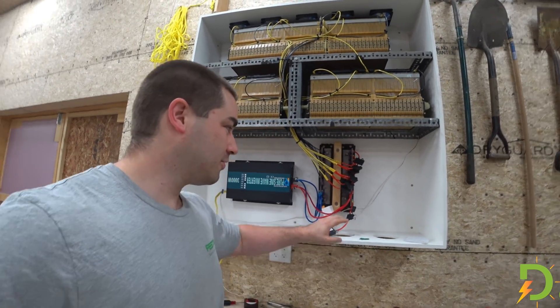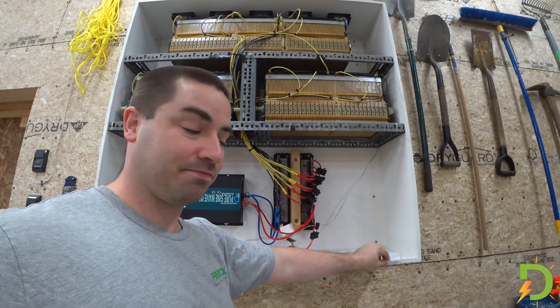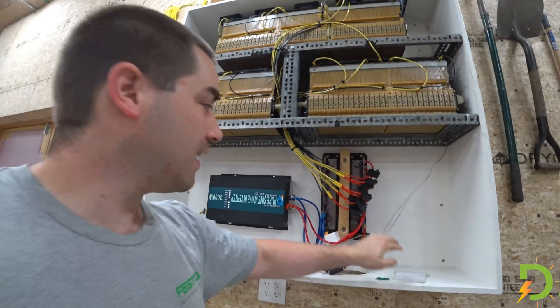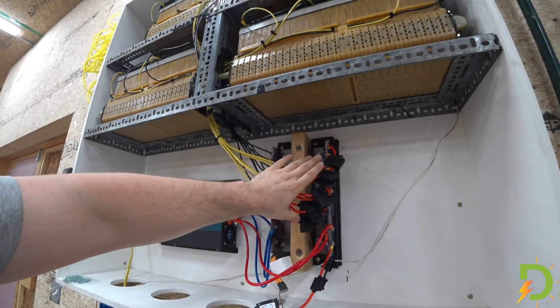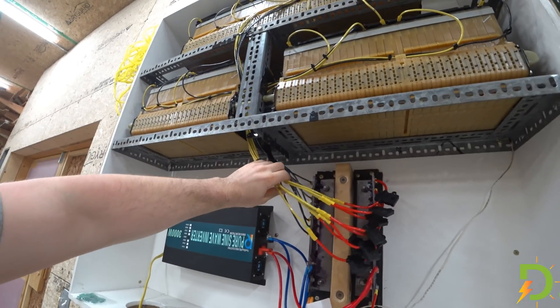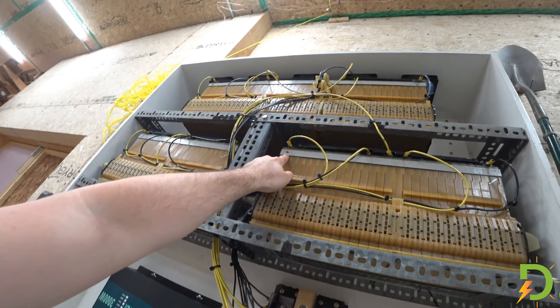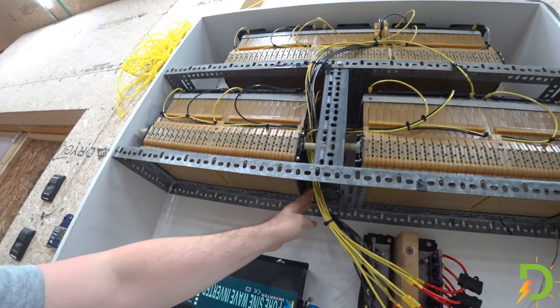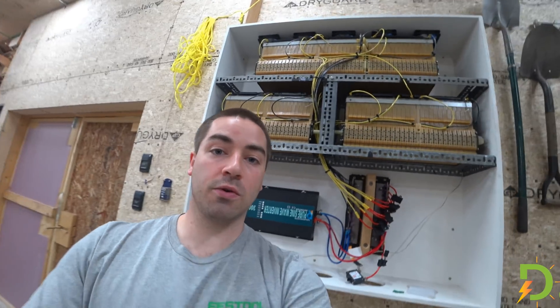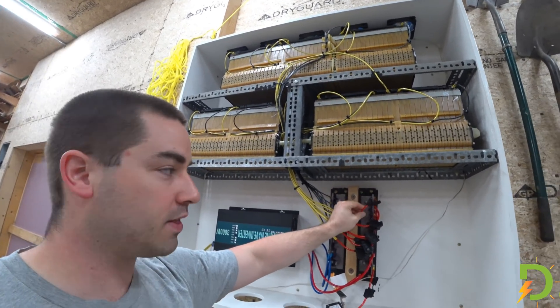Here's what I'm trying to figure out. Do I replace all these fuses with this one? And at the same time, I would move all these fuses from the bus bar location, take down the batteries, and rewire this so that the fuses themselves are up at the positive terminals — because that would protect these wires. That made a lot of sense, and quite a few of you made that suggestion. Because I have eight positive terminals, I need inline fuse holders, which is what these are.